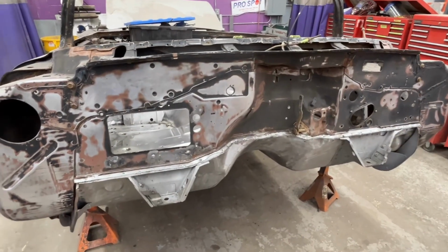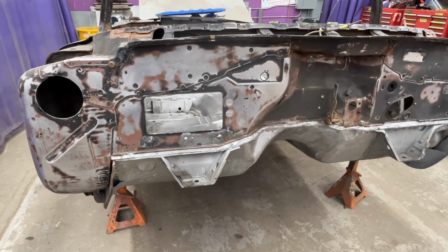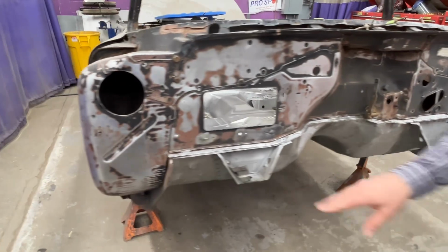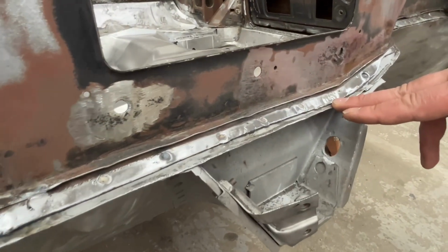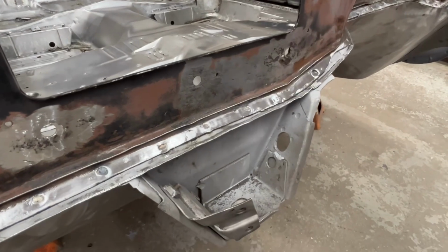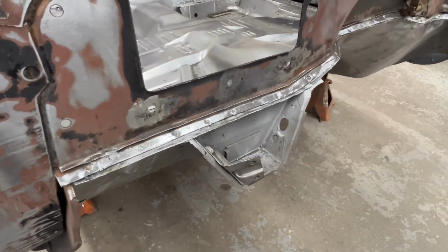Thanks, Ian. So Ian, as you can see, we got some sanded paint and so on. The last time we looked at this car, it was just floor in the front. And you can see that the firewall's in. We've put them all in using squeeze type resistance spot welding, just as per factory. Basically that is 2 electrodes coming down with pressure and running about 7,500 amps, so the resistance between the 2 electrodes just melts the metal together.